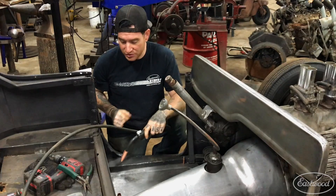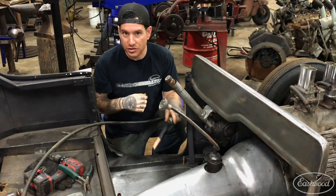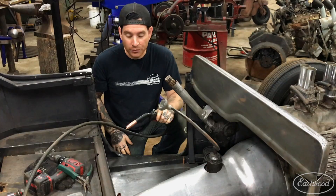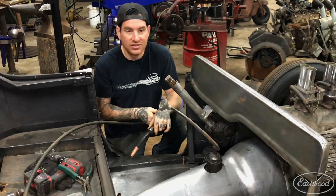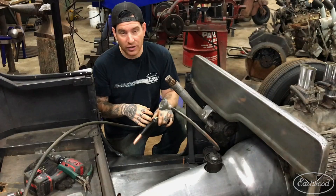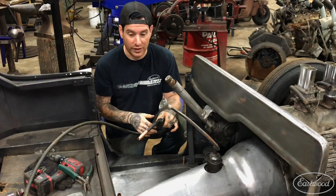Because I'm doing so many welds, this is going to be really helpful to get me moving really fast so I can jump around, drill my holes, and just weld without having to worry about getting everything set up just so. This is also great if you're a beginner and you're a little apprehensive or not sure if you have your MIG's tip set at the exact correct height or the angle just right. By using this it takes a little bit of the guesswork out and it's going to jumpstart you on to making better spot or plug welds.